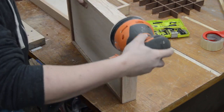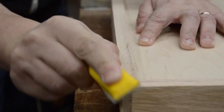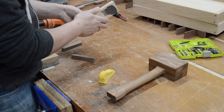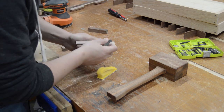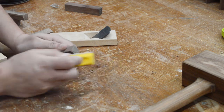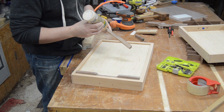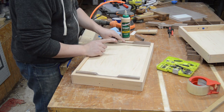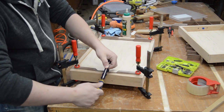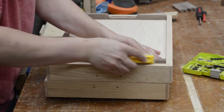I sanded the boxes in preparation for finish. To break sharp edges, I love using the micro-zip sander by Gator Finishing. I used a small Japanese block plane and sandpaper to finish shaping the handles—take care when planing small pieces and keep your fingers away from the blade. The micro-zip came in handy here as well. When I glued the feet in, I clamped them tight to the sides of the trays. I probably would not do this again and would instead space them one or two playing cards away from the side, letting the glue along the top give it strength. With a fit this tight, I ended up having to do a lot of sanding to refine the fit of the feet.